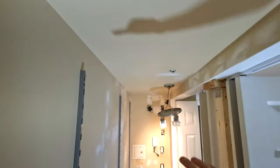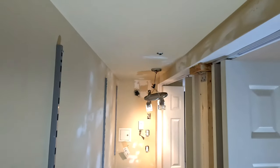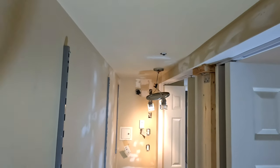As you can see, we have these rails, so we'll have to cut around them. I'll show you how to do it. In general, this closet imitates a room since it has a ceiling and all the walls, so it will be very similar to painting any kind of room. This color will probably need 3 coats because we are using white paint.